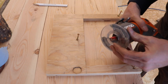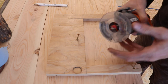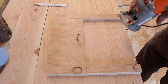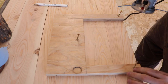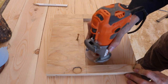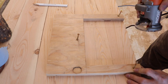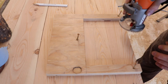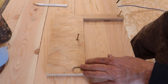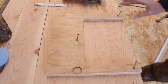this is a mortising bit here for making mortises, half inch. And so the offset from here to the edge of this is an inch and a half. And so I overcut this jig an inch and a half so I can just use it as a guide to follow around here. I'll go back and forth like this and router all that out, and have exactly where I want it, using this as a guide. So let's mount that up. We'll router this out. We'll mount the vise up and see how it works.